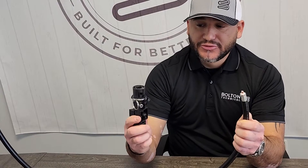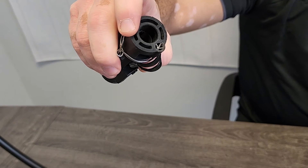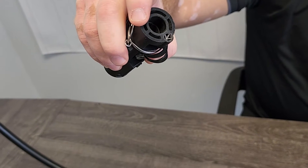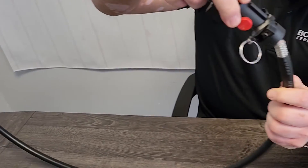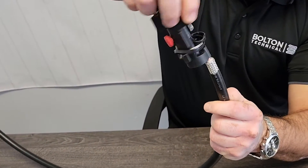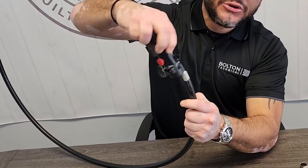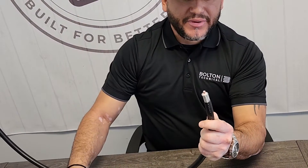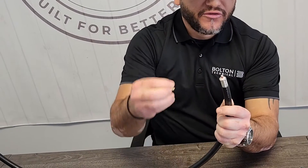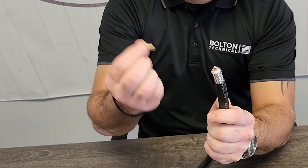The last step for the prep is also on the LMR 600 prep tool. There is a groove here that is going to go over the center conductor. This will prep the center conductor for the pin that goes over it. I'm going to apply this like so and just twist — that's going to lacerate the center conductor and prep it for my center conductor connector. It's a pin that will go over like so, and it just preps it to make connectivity.